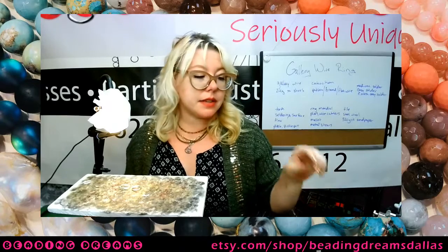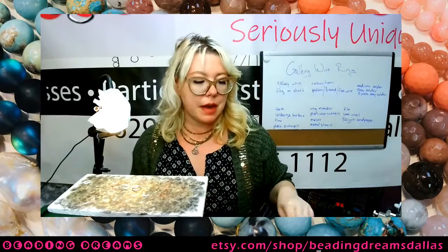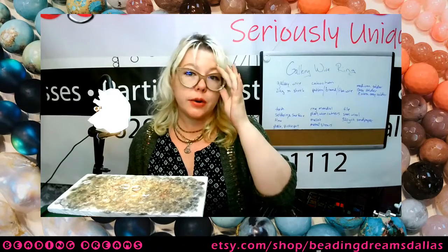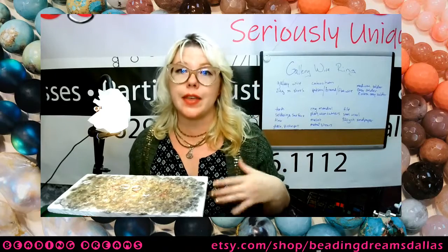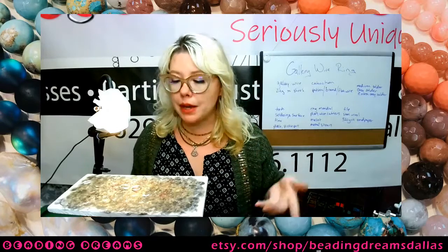But they make solder in different densities. So solder is essentially called filler metal. It's a metal that melts at a lower temperature than the metal with which you're actually fabricating. Okay, so my sterling silver melts at a certain temperature, my solder melts at a temperature lower than that. That's what makes that whole soldering process possible, that the solder melts before the metal.